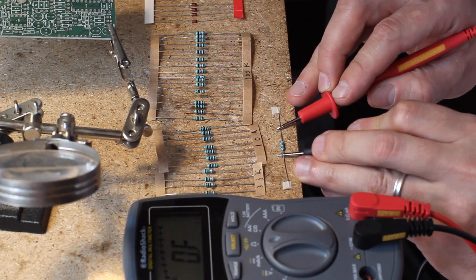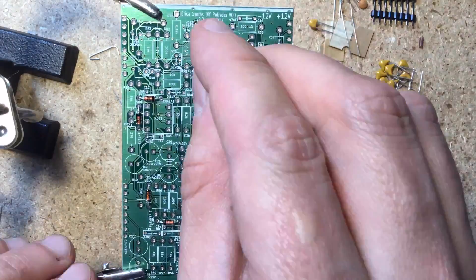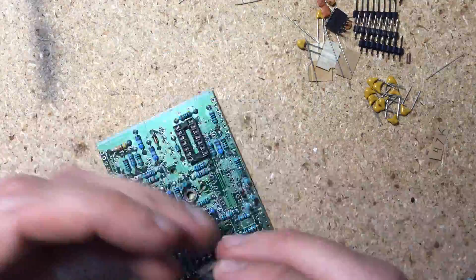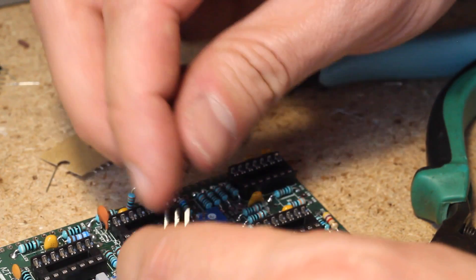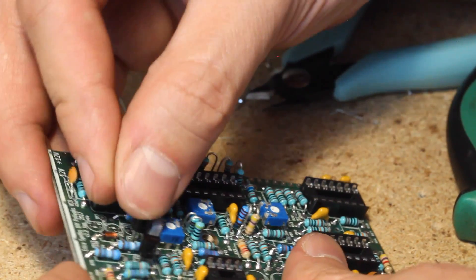Step 1 is to read the manual and print out the component placement PDF files for each PCB you build, one at a time. Have this printout clearly visible in front of you at all times. You may choose to measure and label the resistors ahead of time too. Then start placing and soldering the diodes, ferrite beads and resistors that go flat against the surface. Hold off on the TP resistors for now. Place and solder the IC sockets, then the small ceramic and film capacitors, followed by the vertical TP style resistors and the transistors. Often the transistors come with their leads in line and spread apart, but the pads on the boards are close together and form a triangle shape. It helps to flatten out the kinks and bring the legs together on each transistor before placing them on the board.